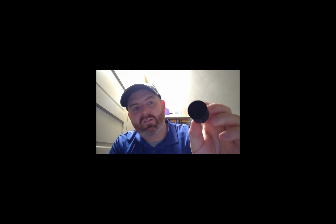These ones are a little bit more expensive. The 10 watt ones are about $60 a piece, but the 1 watt ones are like $5 a piece. So what they essentially do is simulate a connected antenna. You'd still have some short range connection capabilities, even running full power. This thing will essentially dissipate that RF energy without having an antenna hooked up. So you don't have to have an antenna hooked up in a lab environment, but it's a very good tool to have. It cleans things up.